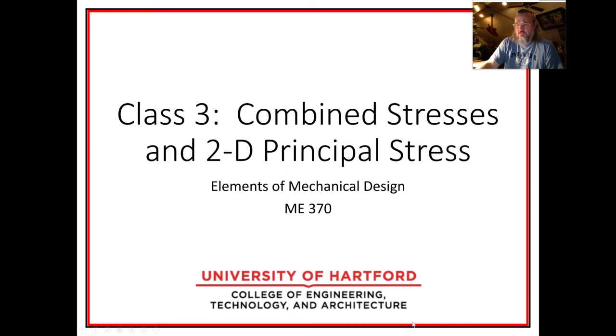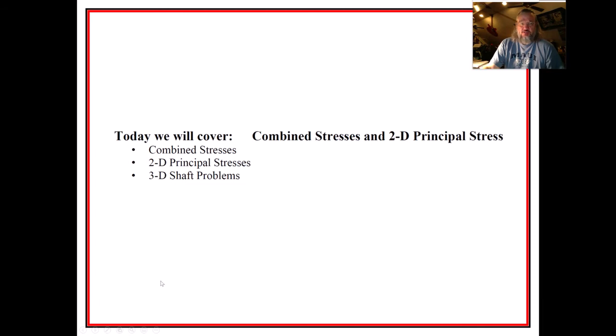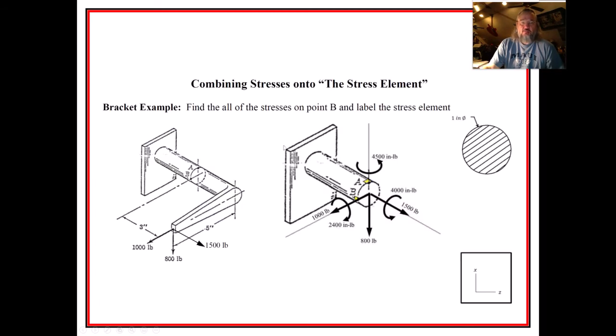So this is class 3 of ME370. In class 1 we reviewed statics. In class 2, we reviewed the basics of mechanics and materials, different kinds of stresses. Now we're going to review and combine the stresses and then find the principal stresses, which is also known as Mohr's circle. So in this first video, I'm just going to go through an example. Again, it's going to be the door handle example, but I'm going to do it for a different point on the thing. So here we go.